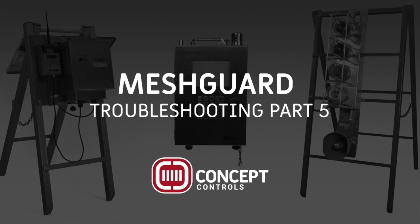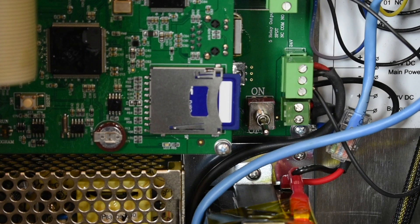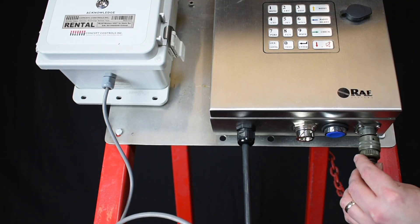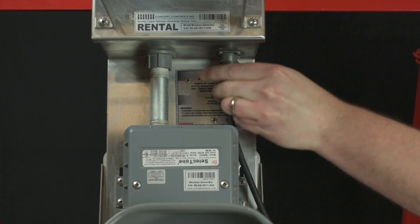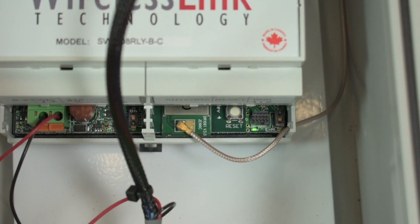Part 5: Wireless Link Communication Issues. If you plug in the alarm bar and all the beacons are flashing non-stop, the unit is not communicating with the host. Check your startup sequence — the FMC and the host should be plugged in and powered up before the alarm bar is powered up. If that didn't fix things, open up the host unit. A solid light means it's connected to a remote unit, so it may be connected to a different alarm bar within range. If it is flashing, it means it's ready to connect but not seeing the remote unit. If there is no light yet the unit is plugged into the FMC, there's something wrong and both the host and the FMC need to come in for service.